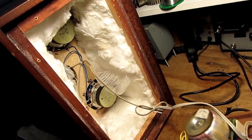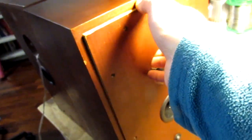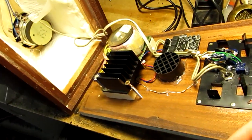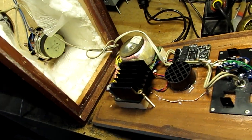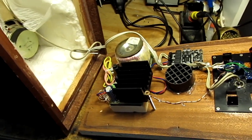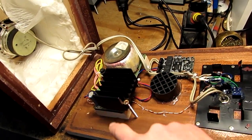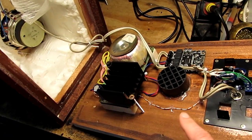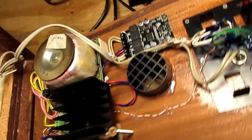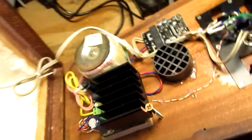They were passive. It was a pain to remove the back here, because someone used glue — I don't know what they used, something silastic. What I have done is removed the back, I have this power supply round, and I have put this single board here — it's a TPA3118 with Bluetooth.